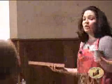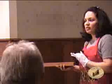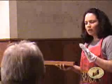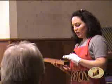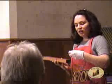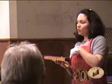Now, what the article goes on to say, which is really what will take your finish to the higher level, is you get a very fine grit sandpaper, maybe 320 or something, and you're going to make a little slurry with it. So what I would do right now, which I didn't bring, is a fine grit sandpaper, and just start running with the grain. I'm creating a little sawdust, a little bit of oil, and the heat and the friction is making the oil penetrate into the wood.